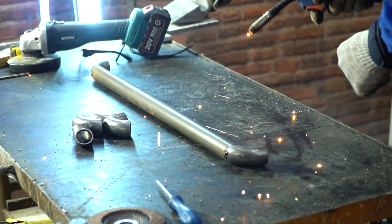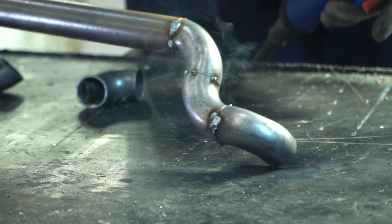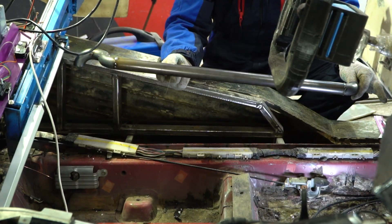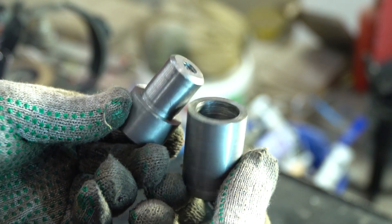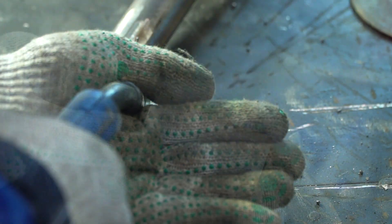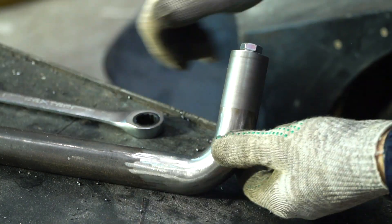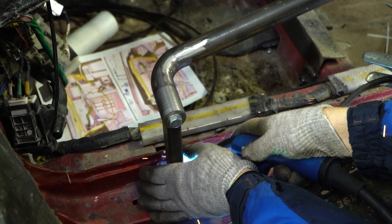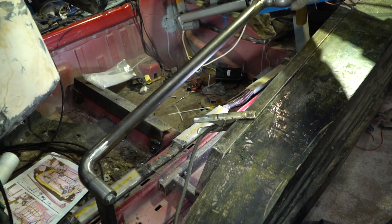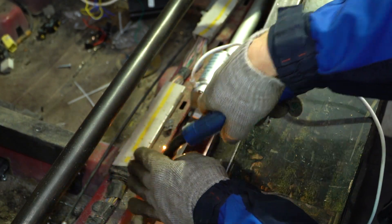I welded the angles to each other and tried the detail in the doorway. Apparently there are some problems in the future since this pipe can definitely damage your elbow with ease, but let's stay optimistic. The hinge joint was sharpened on a lathe — it'll resemble a gate loop and stay in the horizontal plane. I welded it to the pipe for check since the height of the rocker panel was still unknown. The linear drive will raise and lower the safety protector.